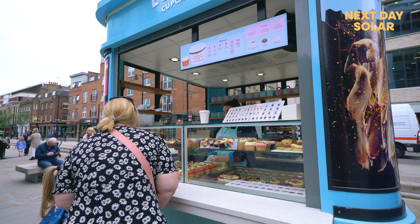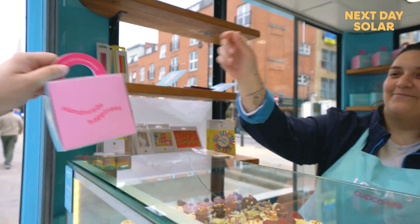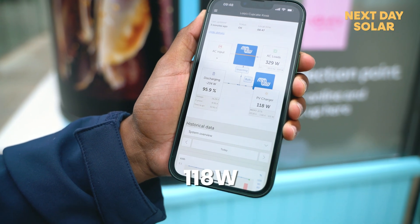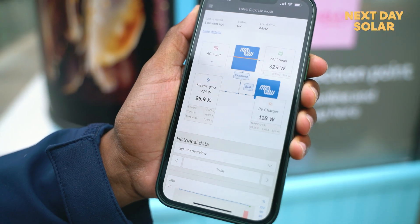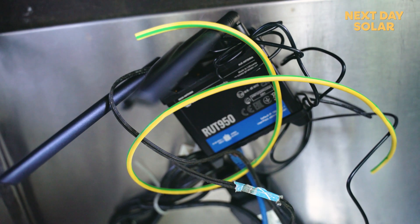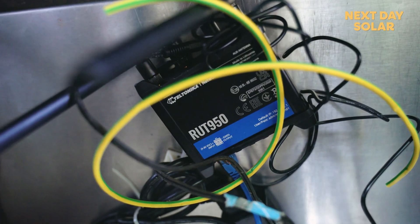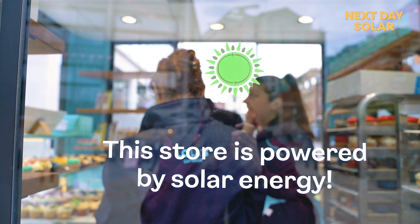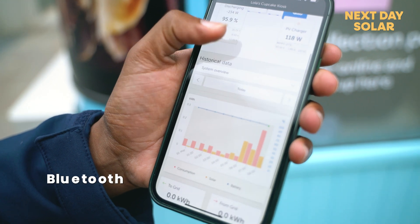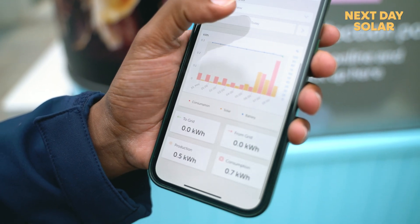As you can see, it's open for business and we're very happy. We now have eight kilowatt hour battery storage. Even on a cloudy day we're getting 118 watts. The batteries are charged at 95.9% and we're drawing a load of 329 watts. We've also included a smart shunt so we can see how much we're drawing at any time, even when not connected to the network — we can still see what's happening inside the kiosk through Bluetooth.